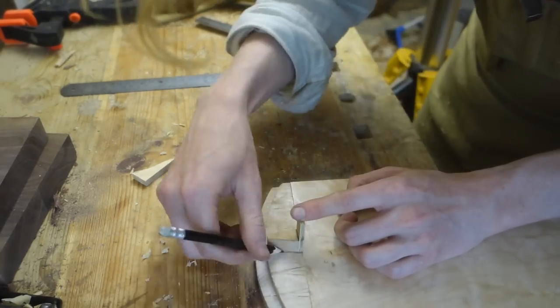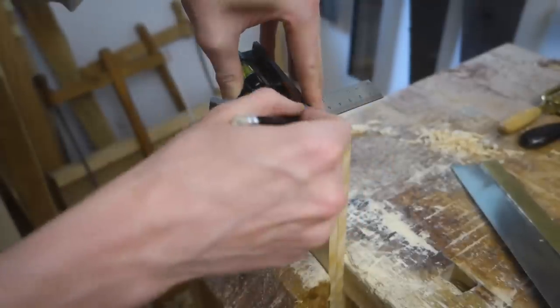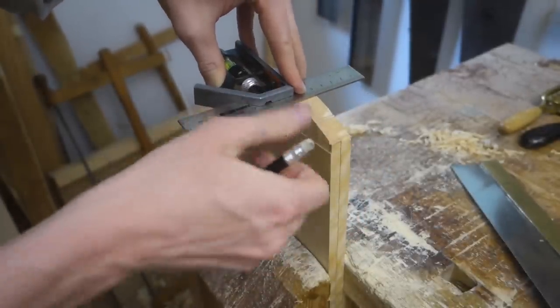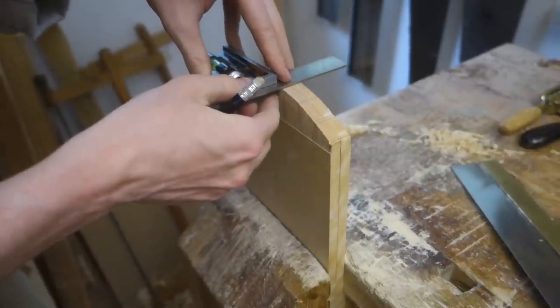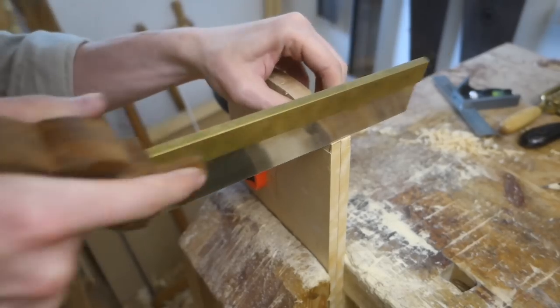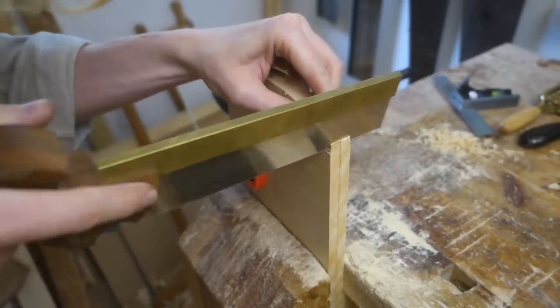This angle block usually references the end of a board, but it works just as well against the baseline when the end is not square. I sawed the tails 2 boards at a time, and since I only have the baselines on the insides, I clamped them outsides facing towards each other, so I can use the inside baseline on both the near and far side.